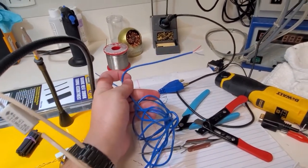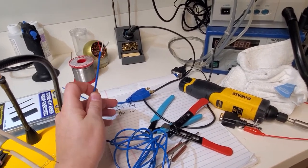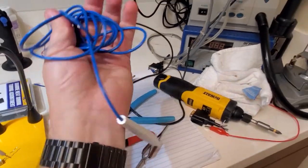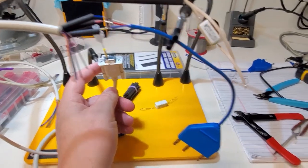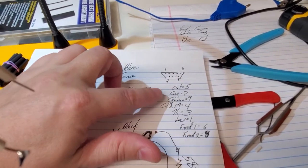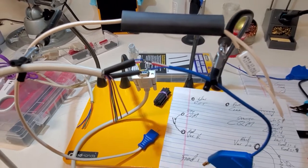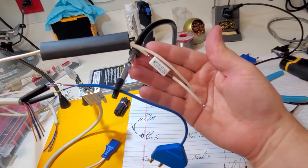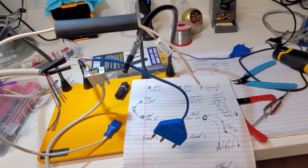I put my meter on continuity and when I depress cut, I check to see which two wires are shorted together. Once you find those two, you establish which one is your common. On these, common is red, white is coag, and blue is cut. So once I've established the pinout for the handpiece, I go back to my female connector where pin 5 is cut, 7 is coag, and 9 is common. You just match those wires up, solder them together, then solder in the REM/CQM load, and proceed to test it out.